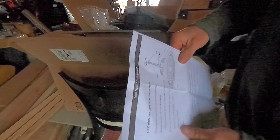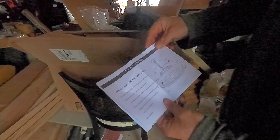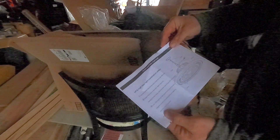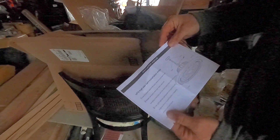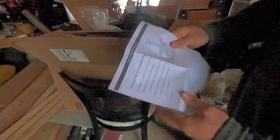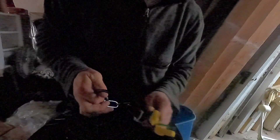I'm going to check these out real quick and make sure they work. The instructions say brown is positive, blue is negative. Yellow is not connected, which I think is kind of strange — you'd think that would be ground. But I tried to check the continuity on the wire and I'm not getting any feedback.